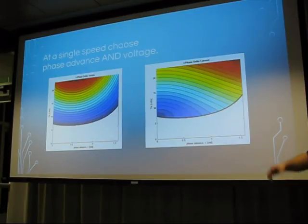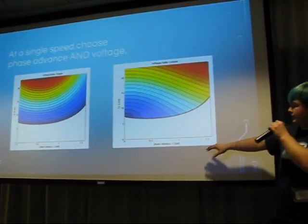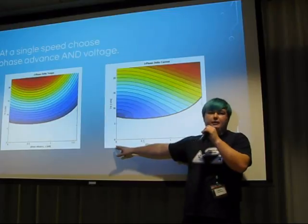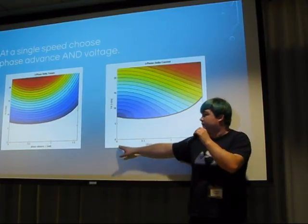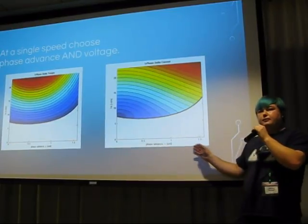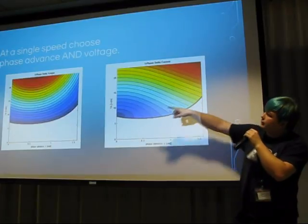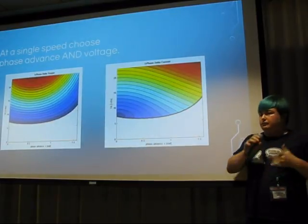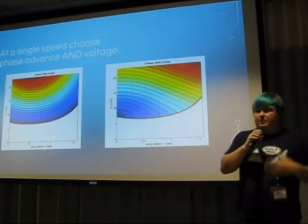In particular, how can we logically explore this space of phase advance relative to the motor? So when I was saying I'm pushing 90 degrees forward, that's this 0. And you can actually phase advance further from that and get more torque, and more current, of course, in certain cases. Let's just say that might be desirable.